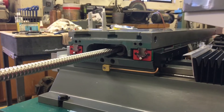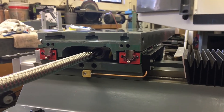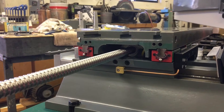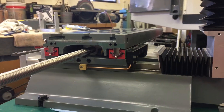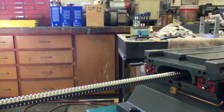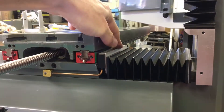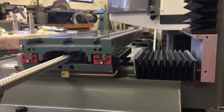That's fine, but I'm all for simple, elegant, to-the-point kind of things. I think if you can figure out a nice clean one-shot setup, go for it. But I see real machines — at least machining centers — it's always some sort of grease lubrication. Grease sticks better to the screws, it doesn't wash off. And if you can keep your screws protected from chip ingress, then you can have it sorted. That's what the plan is here. You always hear 'oh the grease, the chips stick to it' — yeah. So that's the X and the Y, and the Z is the same way. Super simple, nothing special.